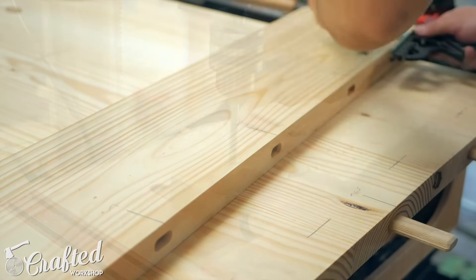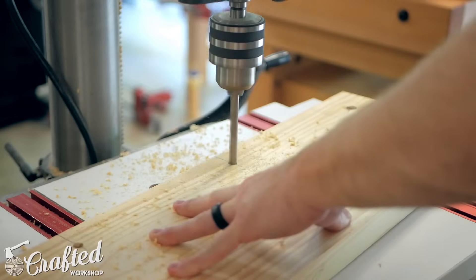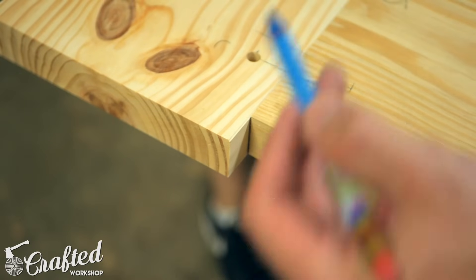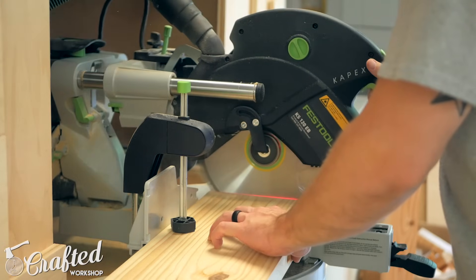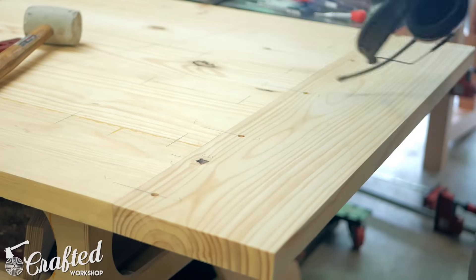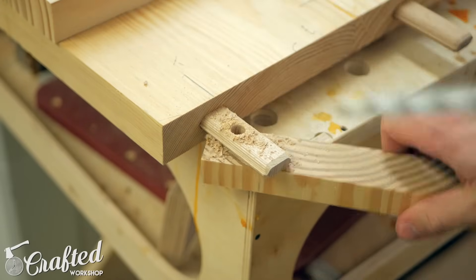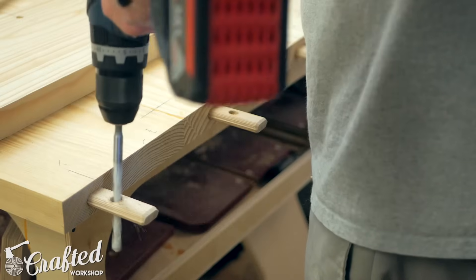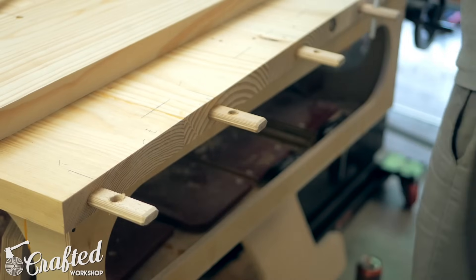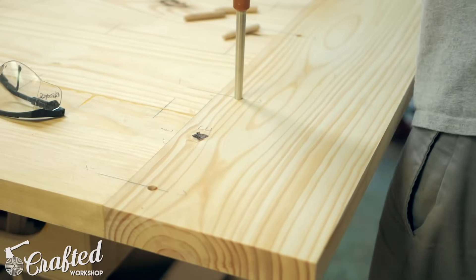Next I laid out the hole locations for the dowel pins which will hold the breadboard ends in place. I used 3/8 inch dowels and drilled the holes all the way through the breadboards at the drill press. I installed the breadboard end and marked the location of the holes on the dominoes using a brad point drill bit, and also marked the overhanging area of the breadboards. I trimmed the breadboards to their final length at the miter saw and tested the fit. I used a process called draw boring on the breadboards — I offset the holes in the dominoes slightly towards the center panel, so that once the dowels are driven in this offset will pull the breadboards tight against the center panel. I drilled the holes using a 3/8 inch drill bit and widened the holes in the dominoes that went with the loose mortises in the breadboard. Finally I used a draw bore pin to expand the hole slightly, which just allows the dowels to go in a little easier.